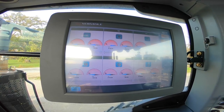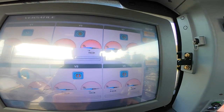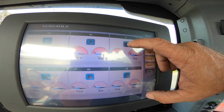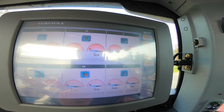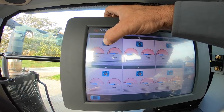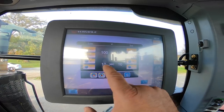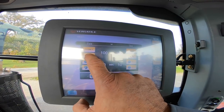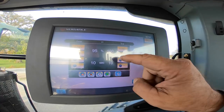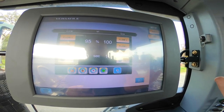Pulling back on valve number two activates it. Valve three is set on continuous flow — like if you were running a planter motor that needed to run continuously; as soon as you kick the hydraulic lever on it runs continuously until you put it back to neutral. To change settings, touch and hold the valve icon. You can set the flow percentage on each side, so if you want it to raise faster than lower or vice versa, you can adjust each side independently, and set timers for how long each action takes.